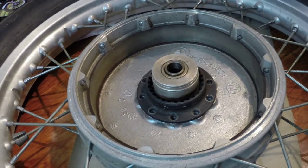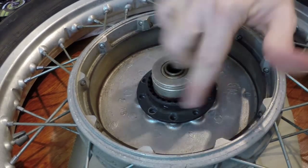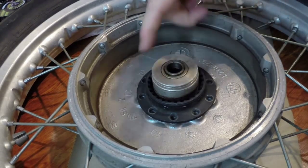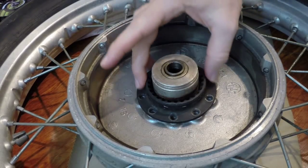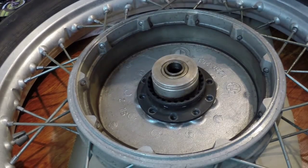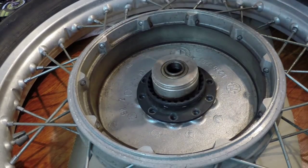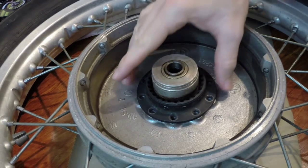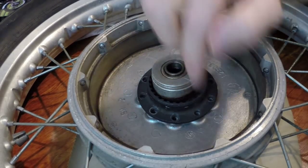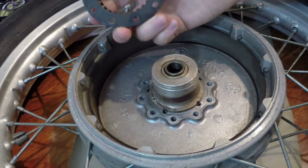The instructions on the website I linked to don't mention it, but I used penetrating oil. Once I had all the rivet heads drilled off, I sprayed penetrating oil — like PB Blaster or any kind of penetrating oil — on there pretty good and just gave it time. Whatever it takes, let that oil soak in around those rivets to make them easier to punch out. Once you've got the rivets drilled out and punched through, the driving dog comes right off.